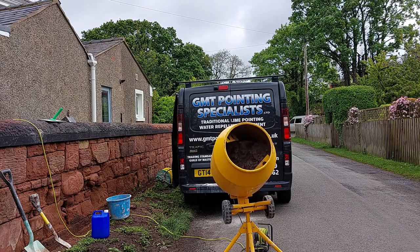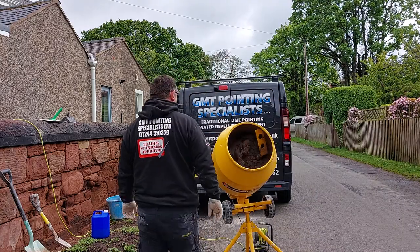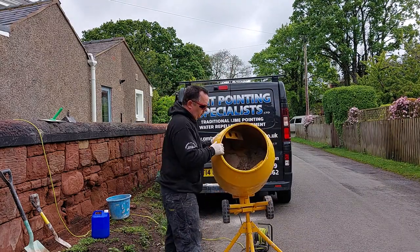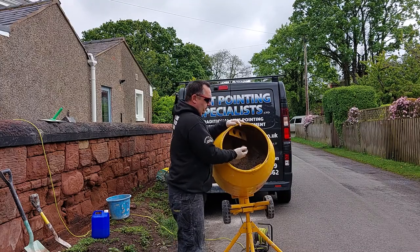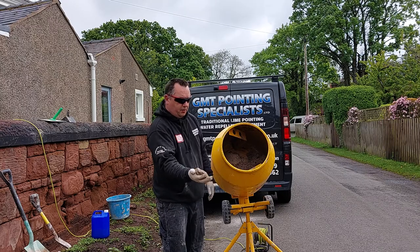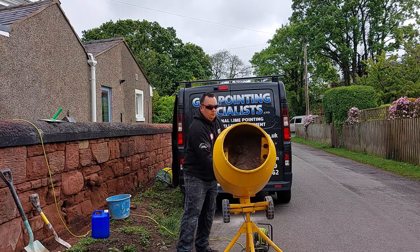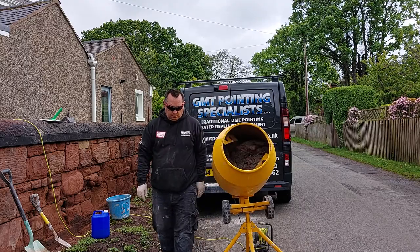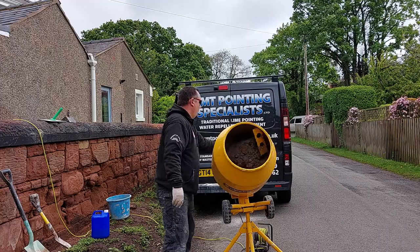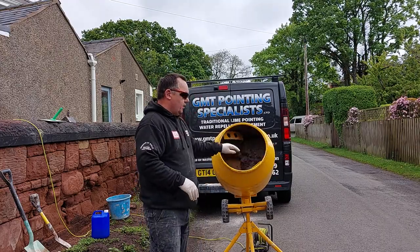So that's had a good 5 minutes to mix. See, it's quite sloppy. That's no good for pointing. So this is where your bucket of dry mix comes in handy. So it's too wet in it.